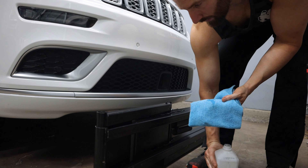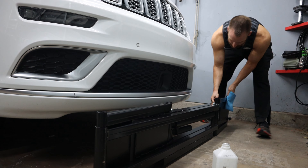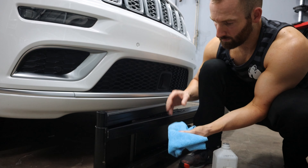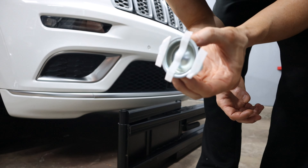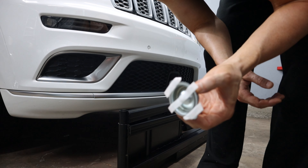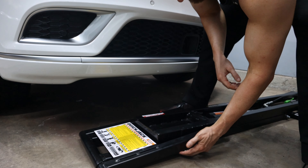I'm going to use the same method of attaching the 1-inch ball bearing casters — double-sided tape. You want to make sure the mating surface is clean with no grease, oils, or dirt, so just wipe it with some alcohol and you should be good. I'll do the same on the back side where the tape is going. With the double-sided tape applied, this is just to test it out, and honestly when I was taking off the previous ones they held pretty well, so I might just keep it this way until one falls off.